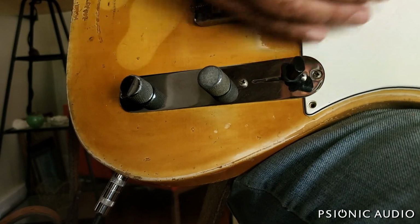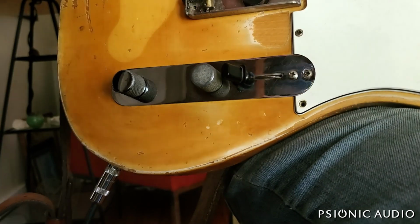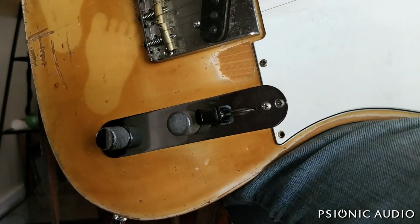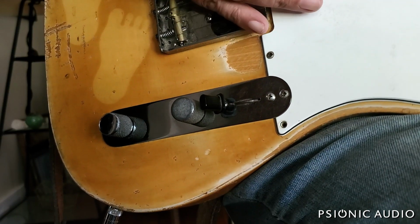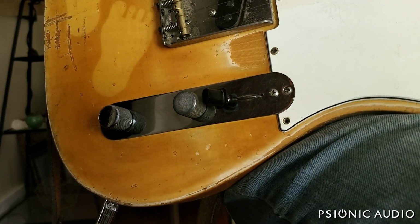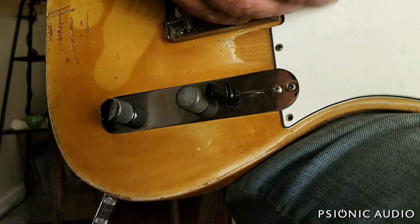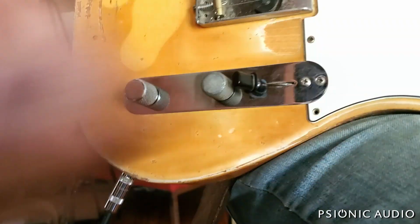Hear the neck now almost louder than the bridge. Remember that there's a lot more mass vibrating, a lot more on the strings closer to the neck. So there's more signal, if you will, going to the pickup. So even this relatively weak neck pickup just has more energy going to it from the strings here because the strings vibrate less by the bridge. So you need to raise the bridge to get this comparable level. So let me raise that just to get comparable.